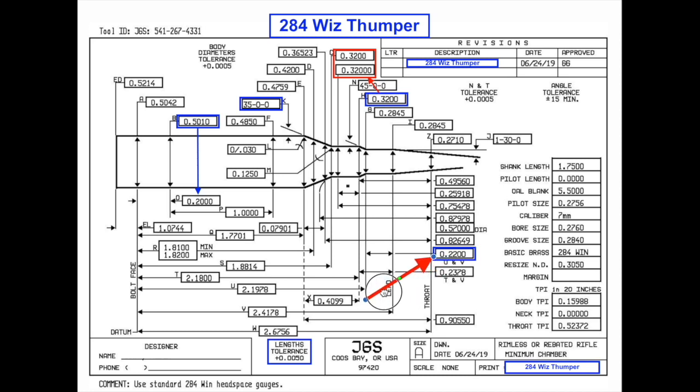Your free bore can be extended — if you want to shoot a longer bullet and wish you had 250, 290, or 320, you can ream that number out. But it becomes a lot less repeatable the next time you do it, because there is a little bit of variance, as opposed to having a reamer designed to cut that free bore. Sometimes if you're playing around with a bullet you might say, can you take it out 50 thousandths? Then if you like the way it works, you could call JGS and say I need this reamer either recut or remade with 270 free bore, 280, whatever you want.